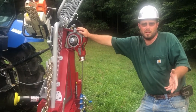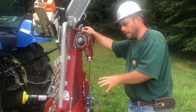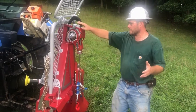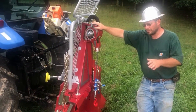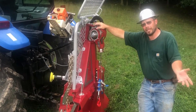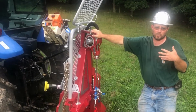You're just not going to pull as much as we do in one shot, but if you're not managing as much, time's not as critical. The safety aspect and environmental impact reduction by using one of these is significant. When I winch the tree up to me, it allows me to get the butt up off the ground where I'm not plowing furrows into the ground — I'm doing far less soil disturbance. Also, if I've got sensitive sites, I don't have to take the tractor down in there. I can sit well outside the area because I've got 200 feet of cable in this case.